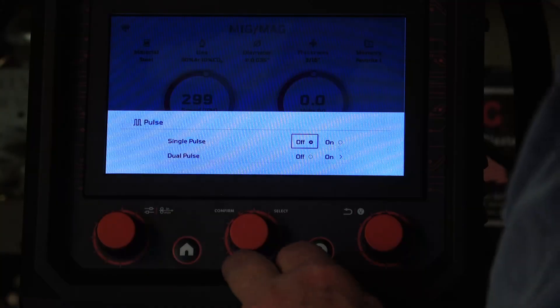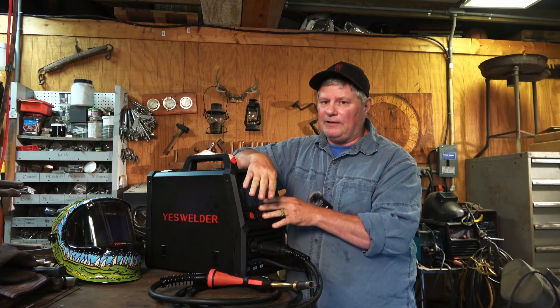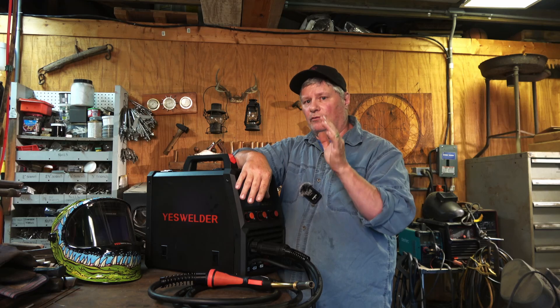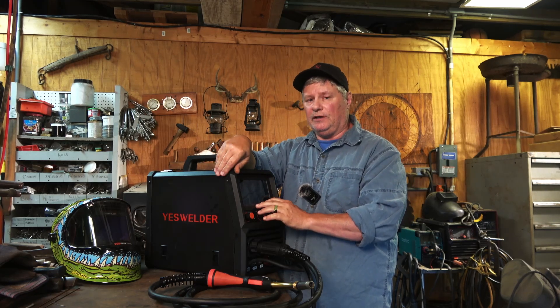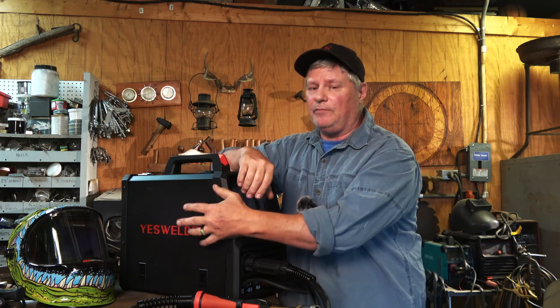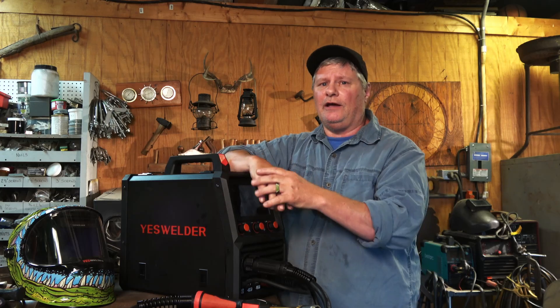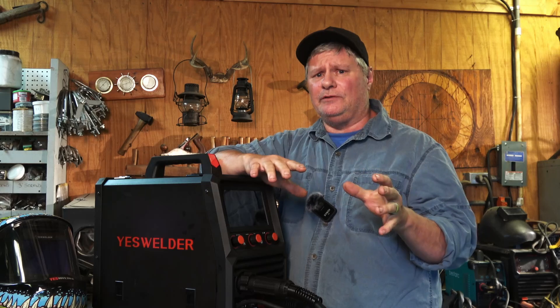The ability to weld a broad range of metal thicknesses — especially down to small-gauge metal — is nice, and the double-pulse option is really cool for that. It'll handle up to 3/8-inch material as well. Having the smart option is what really makes it cool — you just select your thickness and you're pretty much good to go. If you need to change something, it was easy to go on screen and make that change and keep going. I really like that big screen, and having the option to upgrade with the USB-C port is going to be really nice. I haven't tried TIG or stick with it, but I don't see any issues. Those added features are a plus on this MIG machine. Having the option to run gasless with flux core wire is nice too. The ability to run 10-pound spools is also a plus. I think this machine is going to retail around under $450 — to me that's a good bang for the buck.